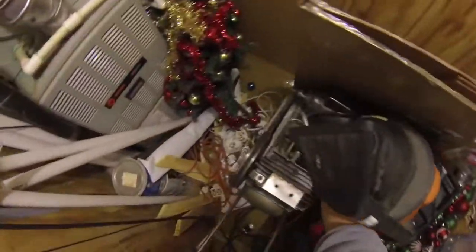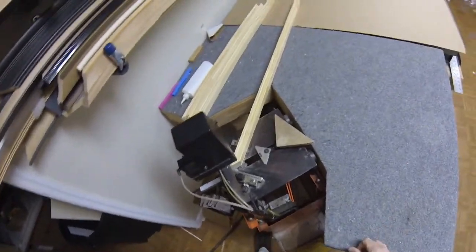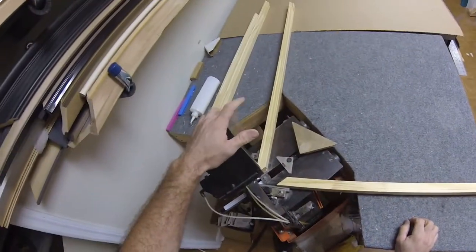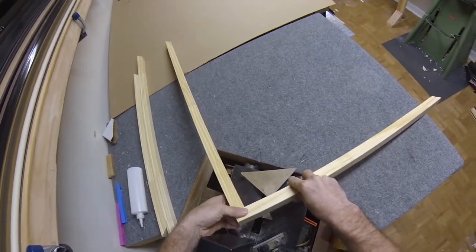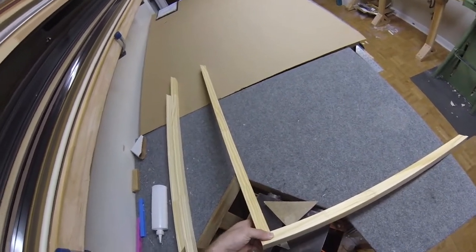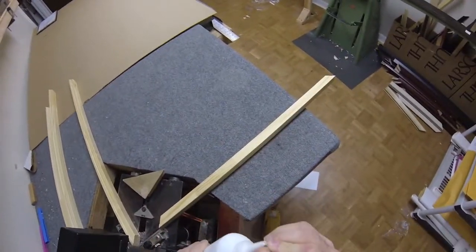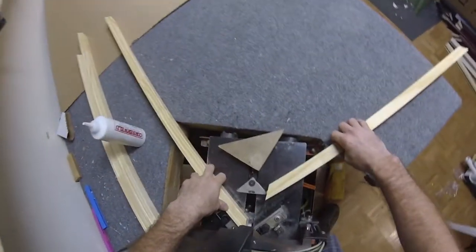Let me make sure our air is working good. Now this thing is called an under pinner — really sophisticated equipment. It drives a wedge up into the miter right here; it's kind of like a 90-degree wedge. What I'd recommend in lieu of this machine is to use some clamps to clamp the pieces together with glue, then Brad nail it — maybe two on each side, two going this way and two going that way. Make sure you get a good amount of glue. You don't need a ton, just enough. That little dollop will squish out as you put the two pieces together.